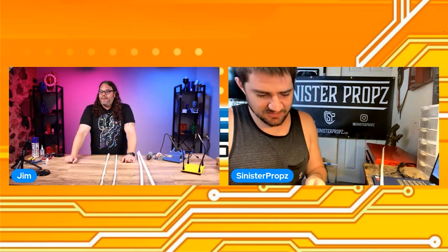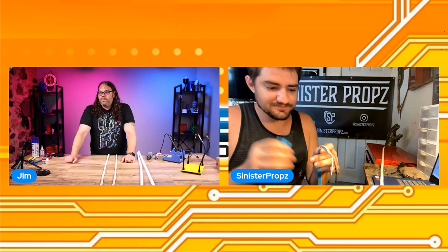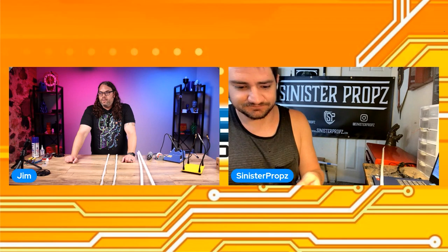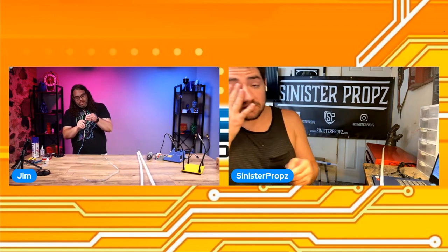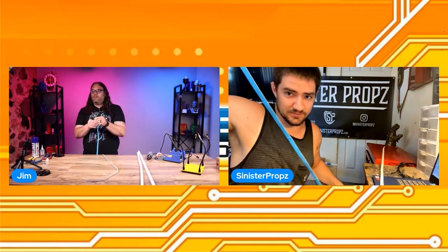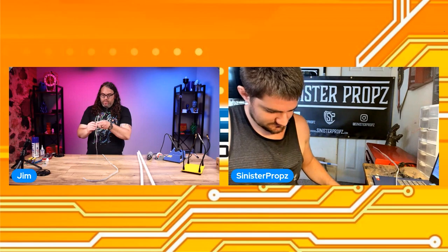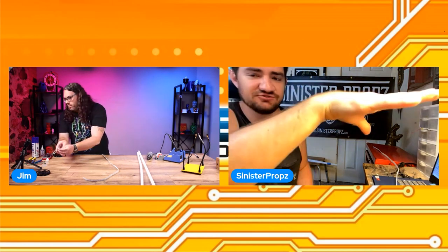So picking up where we left off, I want you to do the same thing to the other side. But do not cut through the 3M tape. Cut in the same spot, leave the tape. So we now have one NeoPixel blade with 3M tape on it, and one that we've pulled the tape off. Do you want me to peel the top tape down a little and then cut it? No, you just cut straight through it.